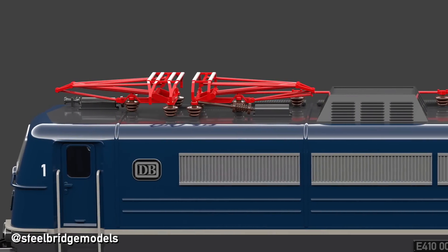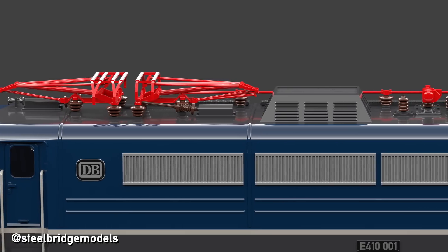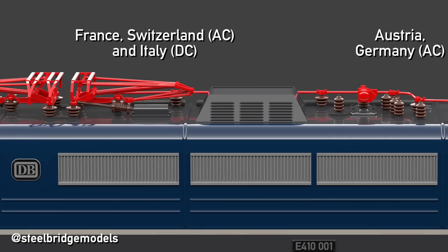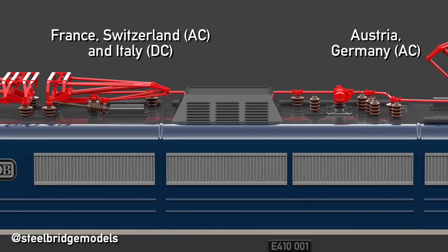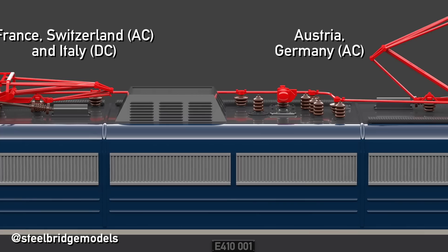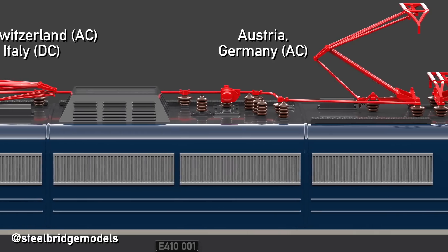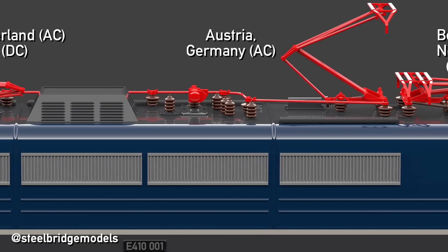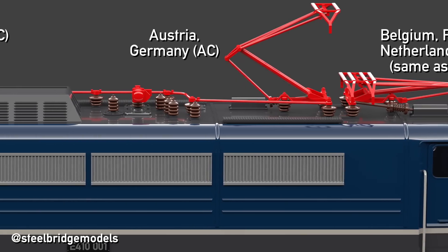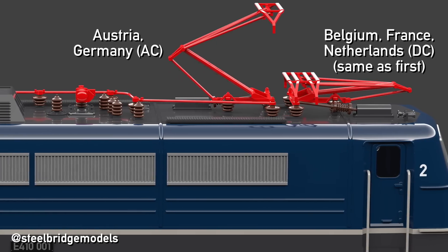We haven't yet talked about locomotives with more than two pantographs. Many European locomotives are equipped with a total of four — but this is simply because they are locomotives suitable for multiple electrification systems using different electric currents. Those locomotives are often required for international train services to avoid the need of changing locomotives midway. Whether a multi-system locomotive has two or up to four pantographs in total, it is the electrical system of the route which determines which one to use. For multiple headers, the distance between two pantographs still has to be kept in mind, and should a multi-system locomotive have the same pantograph type twice, the same rules apply as with single-system locomotives.